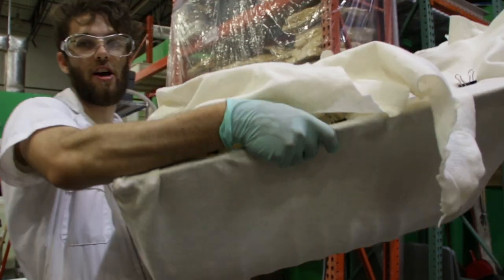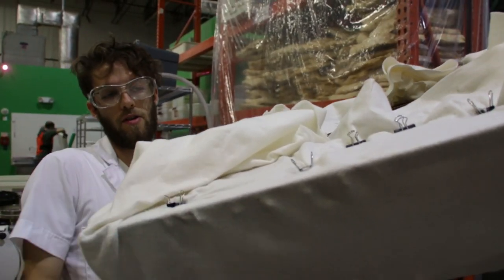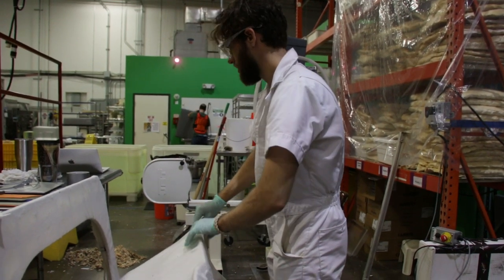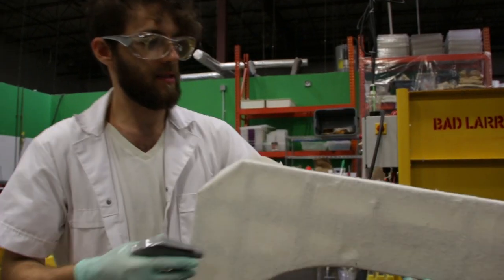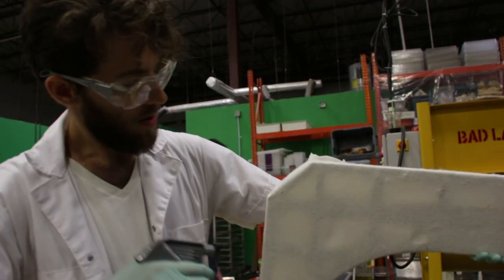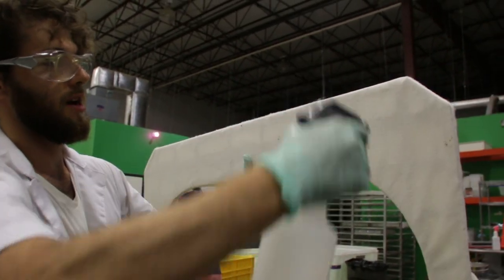This is the positive of the chair — this is where your butt's going to go. We have fabric on it so that as the mycelium grows it will start to eat into the fabric and kind of upholster itself. We're sterilizing it with hydrogen peroxide to kill off anything growing on the fabric that might compete with the mycelium. The top of the chair also has fabric on it, and we're spraying it with hydrogen peroxide as well.